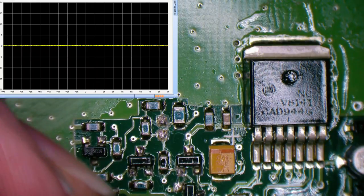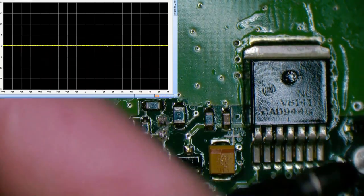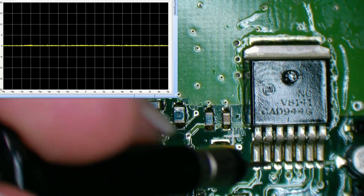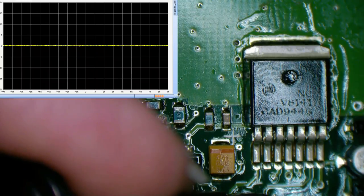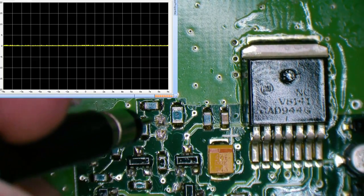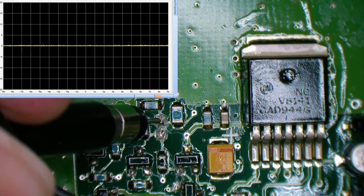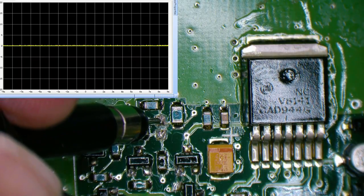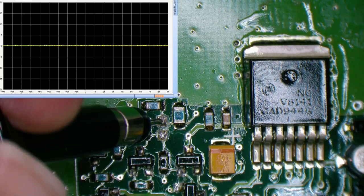All right, so there's a momentary inrush as the large capacitors charge up, but that's to be expected. And if we crank our supply back up to allow for turn on, what is this idle at, about an amp or something? When it is running, the amp chips do get quite warm, even at idle. So we want to know that we have our 12 volts coming in here. And I will probe on. And we do. And we've actually got 700 milliamps being drawn.